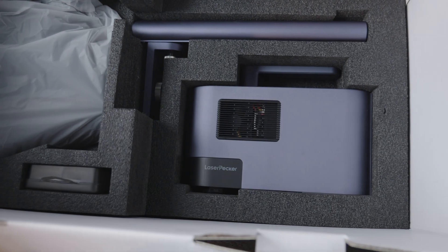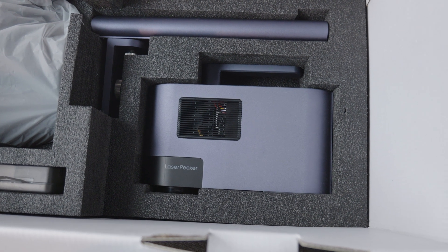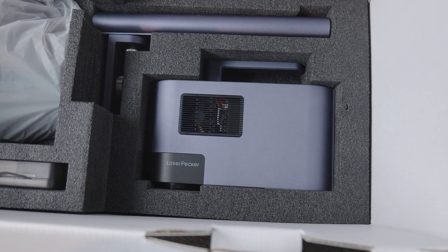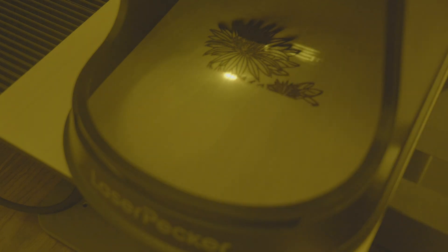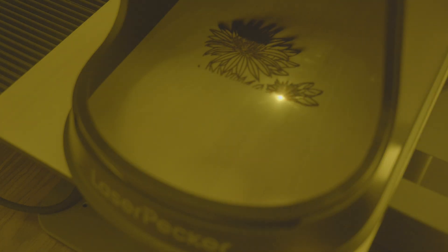This big head is what we just mentioned — the essence. Hidden inside is a 20-watt 450-nanometer diode laser. Compared to the common 10-watt transmitter, it can not only engrave wood, but also support creations on acrylic boards, stones, glass, and even ceramics. It can even cut 20-millimeter thick basswood or 15-millimeter black acrylic.